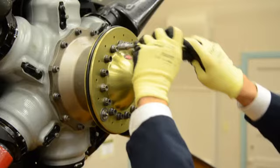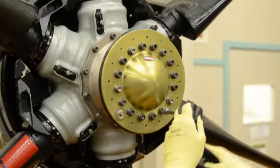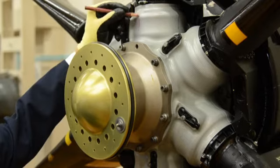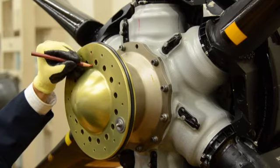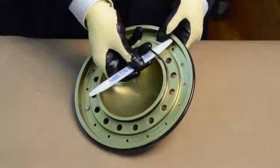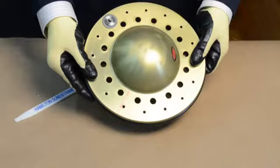Using a standard socket, extension, and ratchet, remove all of the dome cover bolts and washers. Now that all of the dome cover bolts have been removed, use a marker to make an alignment mark on the dome and dome cover — the alignment mark will make the installation easier. Remove the dome cover. Remove and discard the packing. Do not remove the spinner packing or balancing weights that may be attached to the dome cover.